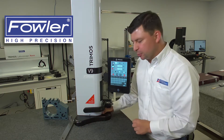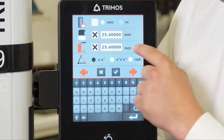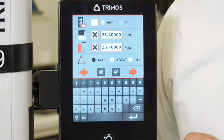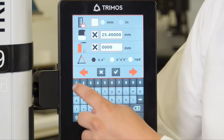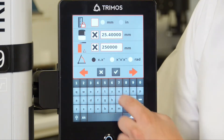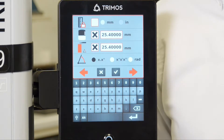I'm using a one-inch gauge block. The display is in millimeters, so we're going to plug in 25.4 millimeters. If that value were not there and I were to delete it, I would simply use the keypad to write 25.4 — metric equivalent to one inch.